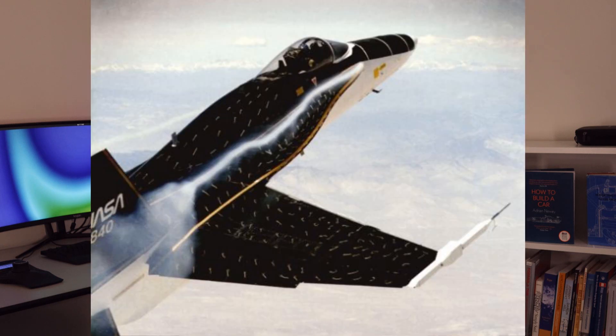But at a certain point, this system will be pushed too hard and will probably burst. Axial flow vortex burst generally occurs when the axial velocity component of the vortex is decelerated too much. This leads to a rapid expansion of the core region and introduces loss into the system. We want to try to avoid any significant vortex burst because then we lose the localised suction from the vortex core itself and will fill the whole diffuser up with loss.